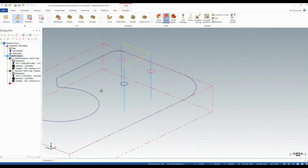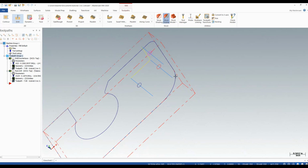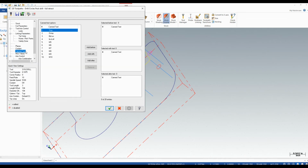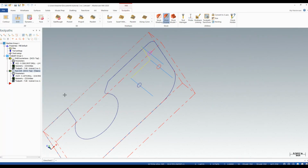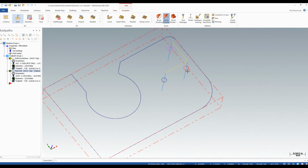The other thing we want to do is put a stop into this program so that we could add a clamp to this area after the holes were machined. To do that, I go into my last operation, come down to canned text, and choose stop and say add after. This will add a stop into the G-code once posted, stopping the program, allowing the operator to move a clamp, remove a clamp, add a clamp, whatever needs to be done, and then restart the program with the next operation, which is going to be machining. We will cover that in the next video.